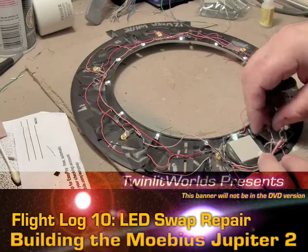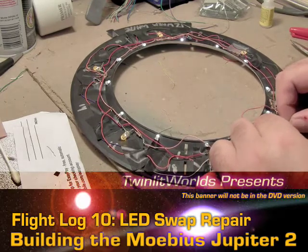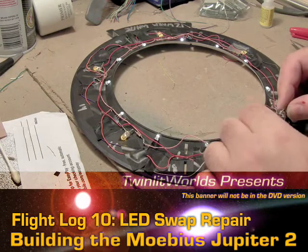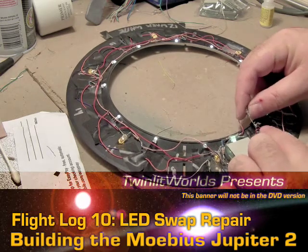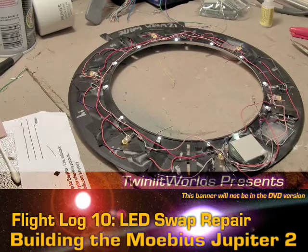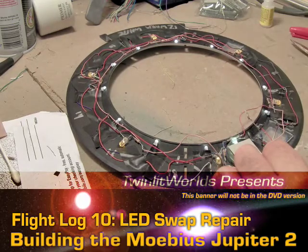It's too bad, I was hoping to keep this simple, but sometimes you just can't do that. This will make the whole situation just a little cleaner than it would have been had I left it. It would have been nice if it worked out like that. And this could be why — you see this solder joint here, this is above the resistor. So all the power going through here just went straight to that LED and probably killed it without even saying how do you do. In fact, that's just about a guarantee of what happened.